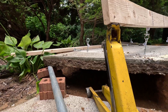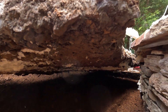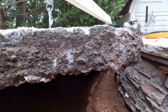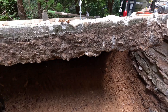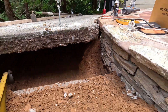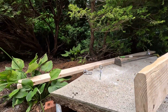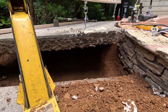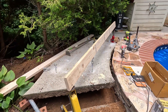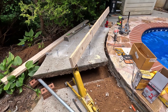Now I have this plate lifted up pretty high and I managed to scrape off most of the foam from underneath. I also realized I don't need to take all of it off — I can just remove some soil from underneath the plate to lower the level a little bit, and that's what I did. I got a bunch of it out on all sides, so it should be an inch or two down now, and I'm hoping the plate will come down right where it needs to, or lower, so I can lift it with foam again.